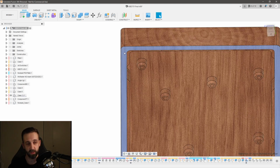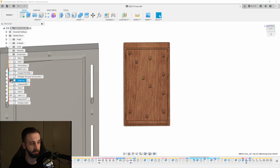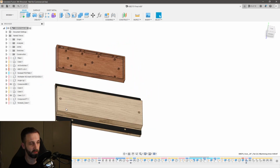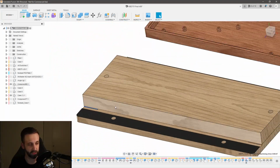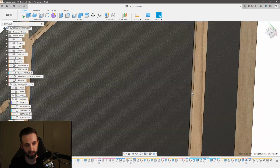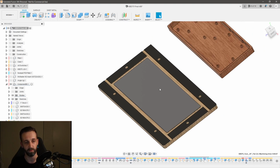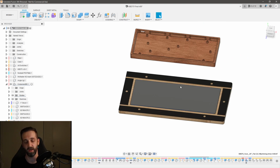So what I did was I applied some blue tape to this rim right here, and then I taped down onto my wasteboard, applied some super glue, like spray CA glue, and then stuck it down as close to perfect alignment as possible. Now, thankfully, I had my jig, so let me pull that up. So I used these corners, actually not these ones, because now it's smaller. I used these inside corners right here where my model was, and I tried to line that up perfectly. And with that, I was able to basically run a new operation and trim the outside, and I narrowed that in, and I was able to get a decent result. I almost lost the entire project because I wasn't paying attention.